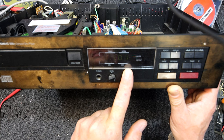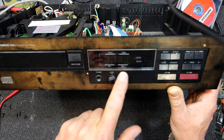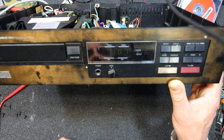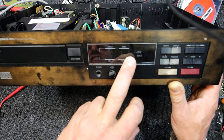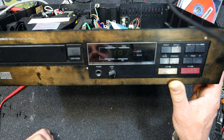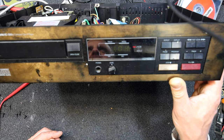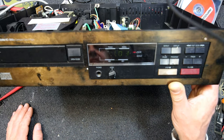These displays are normally multiplexed, which means they're sort of scanned. They run different segments of the display - like the E, A, B, C, or D segments as they call them in seven segment displays. They address one display, turn it on, while at the same time putting a segment on, then flick to the next unit. It's a constant flashing of each segment, but it happens so quickly that with persistence of vision they basically look lit up all the time - much like a light globe running off 50Hz AC, technically flashing 50 times a second but it just looks like a solid light.